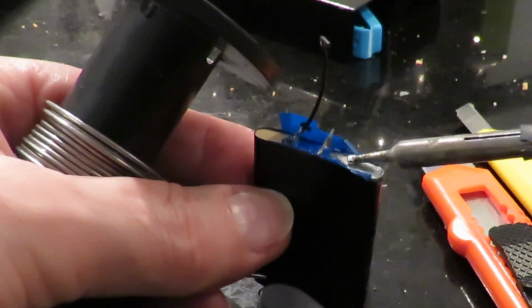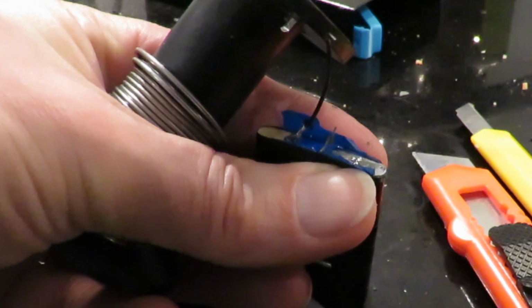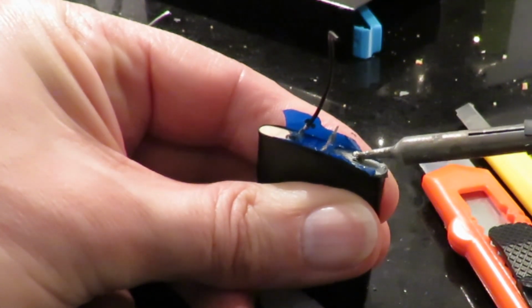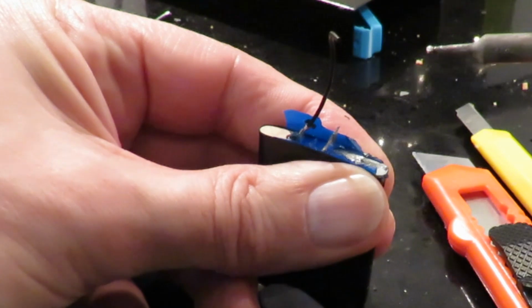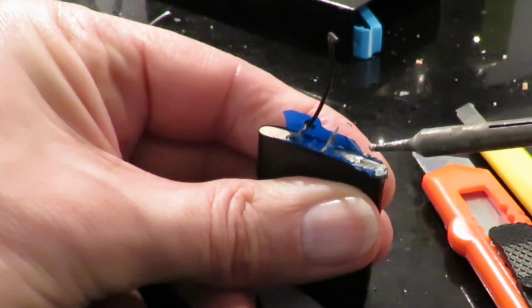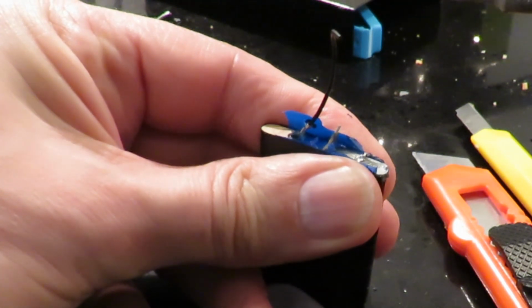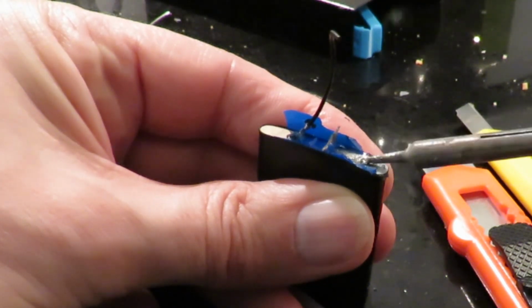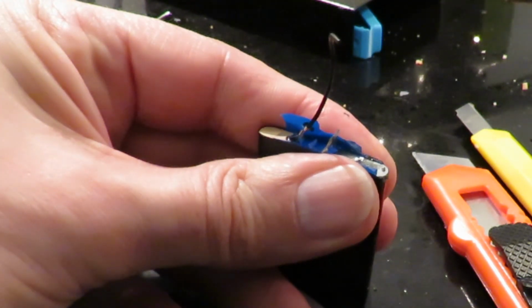How about onto that metal surface that we've just been trying to clean? There's warmth there now. We don't want warmth. Cool down again before I touch it again. Trouble is, it's got to be hot enough for the solder to melt and combine with the aluminium, and that's probably enough to set the LiPo off. It's definitely not soldering to the aluminium.